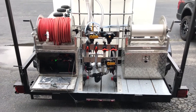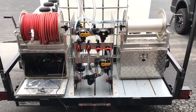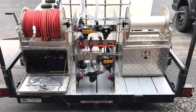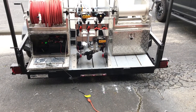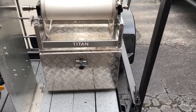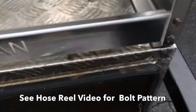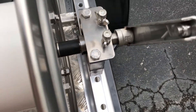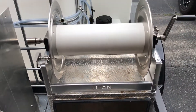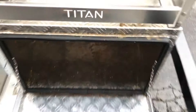We've got the boxes in position and everything's mounted. The two boxes are aluminum, from Amazon, about 18 by 24, and they work well to hold these Titan 18-inch hose reels. We've mounted the hose reels onto the boxes by going into the corners — you can see we've got a bolt through the box, bolted with stainless steel bolts. We use stainless steel because of the chemicals and water. Inside, we've bolted the four corners through the floor of the trailer from underneath to secure them.